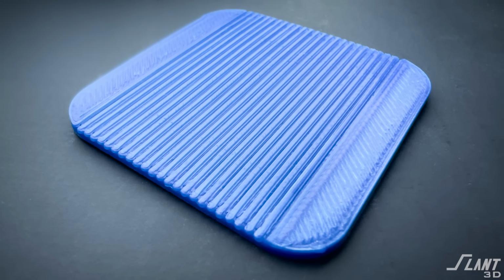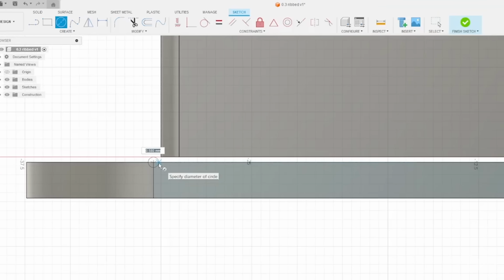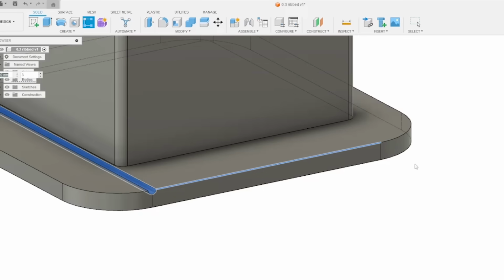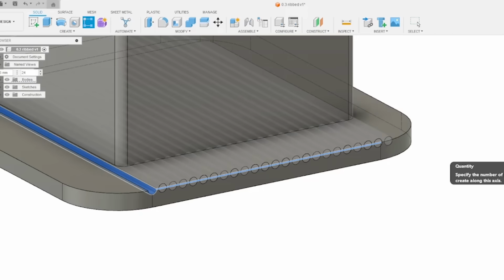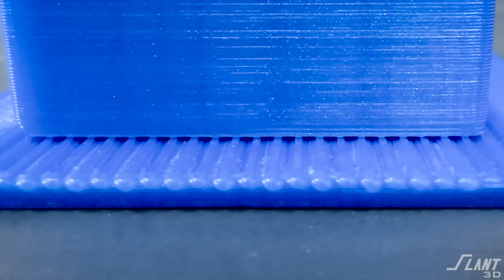But if you are trying to stick the part really reliably to the raft with a really high warp material that, like, the little struts don't work, you can't just space it just right, all the rest of this, a thing you can do is effectively create long lines of connection so that you have this kind of Velcro disconnect feature. The way of doing this is with just hemispheres, and then make sure that each one of the interface locations is one layer thick. That simple one layer lets us break it away really easily, because one layer of printed parts will break away really easily.